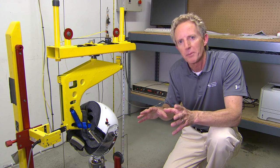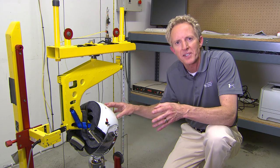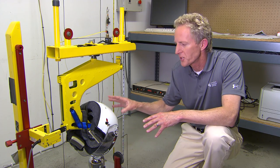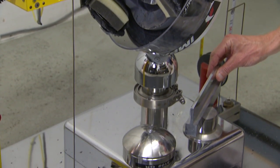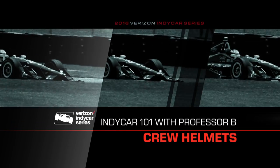There is a random sampling of helmets that make their way into this room. This is a helmet testing apparatus, essentially the same device that's used for Snell certification. This helmet can be raised to a height of as high as 9 feet and dropped on various anvils to be sure, before this helmet goes out the door, it exceeds its certification.